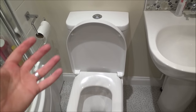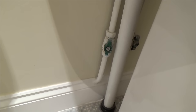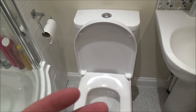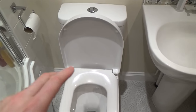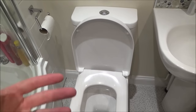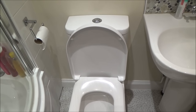To begin with we need to turn off the water supply into the toilet. Have a look around and you might see that the pipe feed into the toilet has a valve, or it might be one that you need to put a screwdriver in and twist to turn it off. Unfortunately on this toilet it's all sealed so there's no obvious valve. I'm going to turn off the water at the main stopcock because I know by the speed it fills up that it's running off the mains. If it fills very slowly then it's probably from the tank up in the attic, but this one fills within a few seconds so I'll go and do that now.